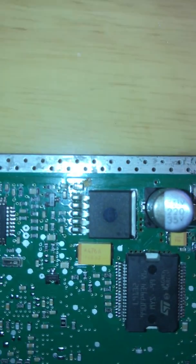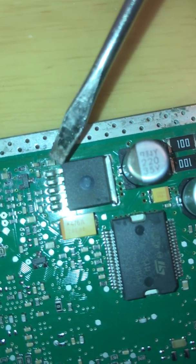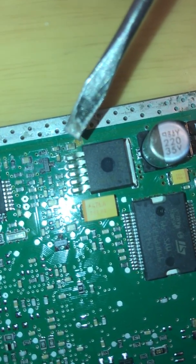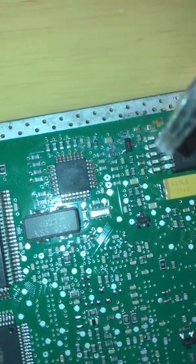Now, the side that is corroded — that side when it's on there — is this area I first started wanting to look at. You can't see anything obvious until you get to here. There's a little bit of corrosion there — I don't know if you can see that, let me get a pointer. There. There's corrosion on the actual board itself. There's a trace which goes up — now I'm not saying that's a definite issue, but that is a fault there along this side where it has been sat and corroded. You can see a lot of water's got in there and dried off on the board — you can see watermarks.